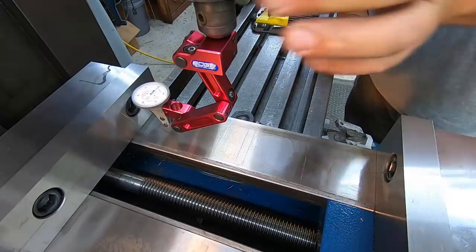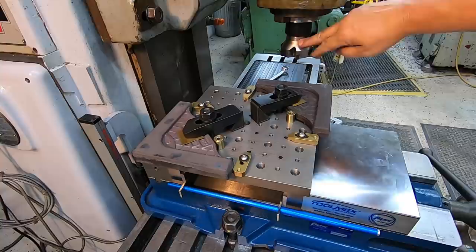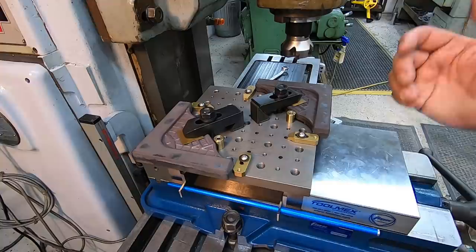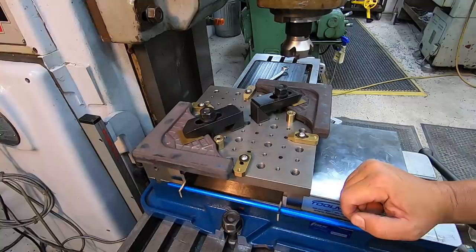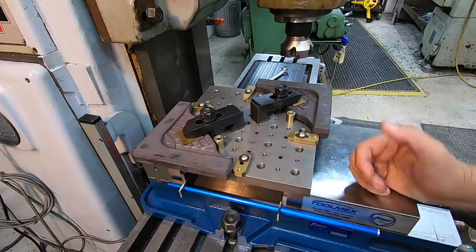We're getting everything set up, and once again, my plan has been foiled because I don't have enough reach out here with the cutter the way that this vertical head is mounted up. So I can't get all the way out here to cut this square over here the way I want, so I think I'm just going to take this setup off, and I'm just going to do one at a time over here on this side right there. And once this is set up, then I'll just have two dimensions that I can hit every time on my DRO up here on the center line on where to cut it. So we won't really worry about it.